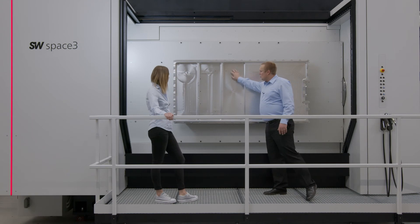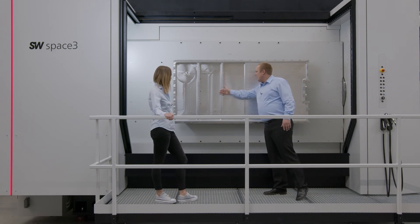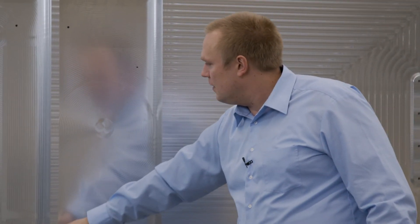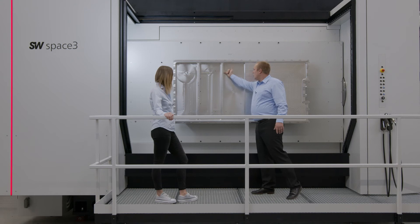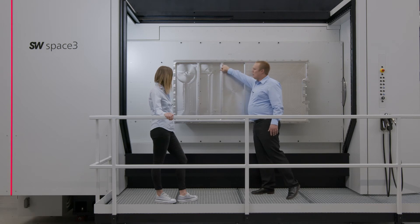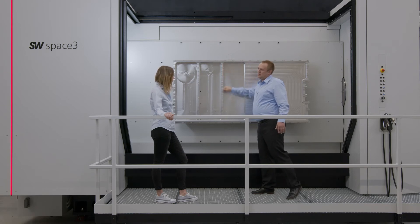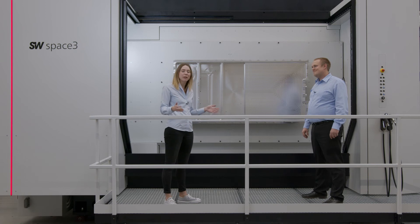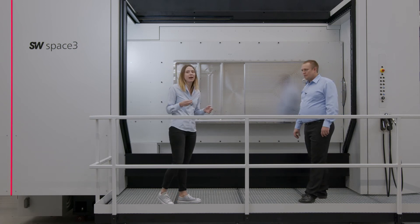However, we use a probe for this. First we probe the plate, and then we probe each of the side beams. These data are then fed to the NC, which processes them and mills the cross bars to the right dimension. Afterwards we probe the sides left and right to ensure that all the bores are drilled to the center of these cross bars. That's all really complex, and there's a lot to consider in this process — how do we make sure throughout the whole production that everything goes well and the finished workpiece is a high-precision part?